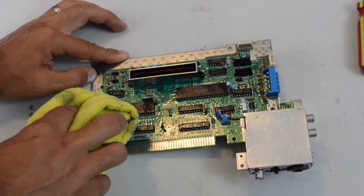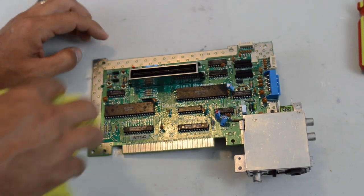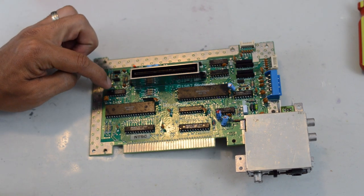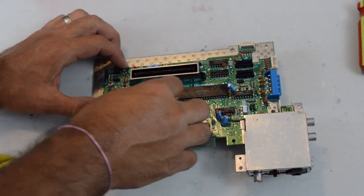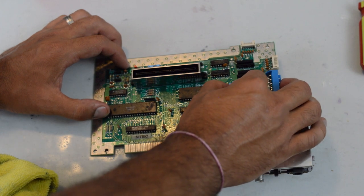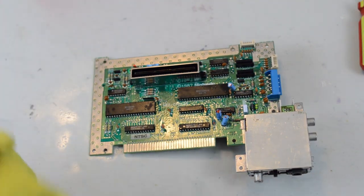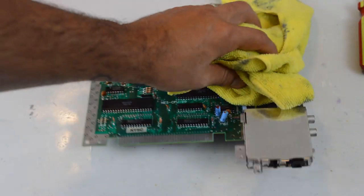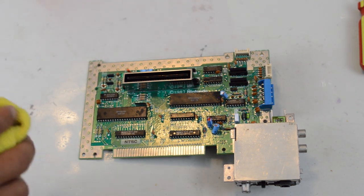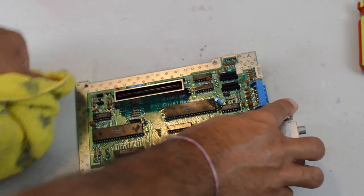Same thing — just wipe it off. If you do bend any of those caps, try to lightly bend them back in place. My first press was a little too hard and I might have bent this cap to contact the part right there — you don't want that. So always make sure these caps are not in contact with any of the other components. And there we go — we should have a nice functioning and clean board now, unless there is a specific component that was damaged.